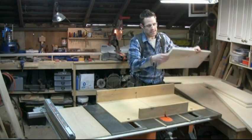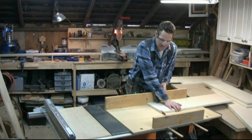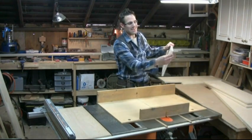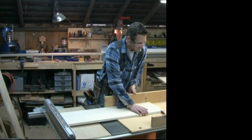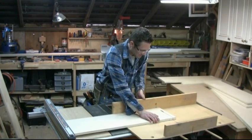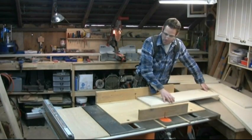There's a little bit of tear out on this because this is the manufacturer edge. I'm going to cut off both sides a little bit — I made it for 36 inches so I'll slice a little bit off this side to get rid of that. That way I don't have any tear out; it's a nice clean 90 degree angle. My fence is set at 34 and a half inches. Do not attempt to make this cut without a cross cut sled — do not try to freehand it. Use a cross cut sled or a circular saw with your square cut. I make my cross cut. Done. Now this piece is exactly the same as this piece, and this piece will be the same exact piece as the one before and the one after.